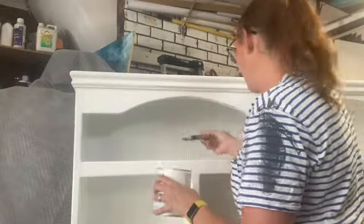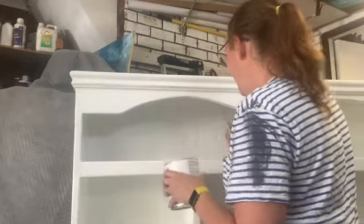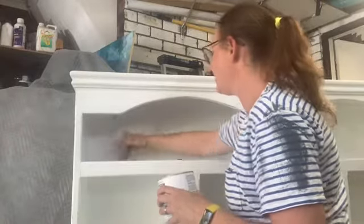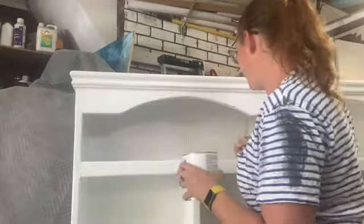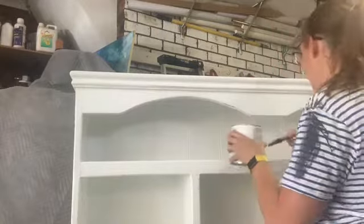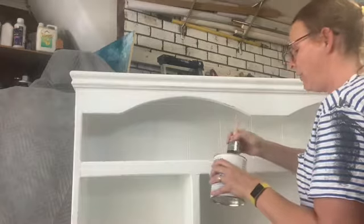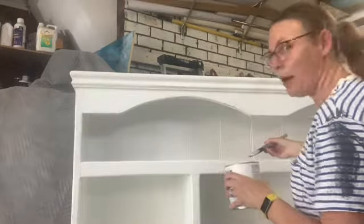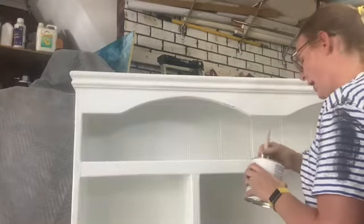This unit is something I got free. It was not in great condition. Not quite sure what I was doing with it. I had done a homemade chalk paint because I was trying to just experiment and see what it was like. I like to mix things and make things up myself and play around a bit. The recipe I used was a quarter cup of calcium carbonate — I just got that from my local pet shop — and then two cups of paint.